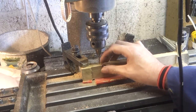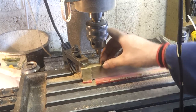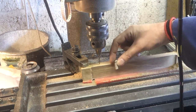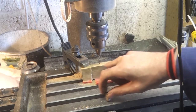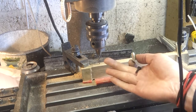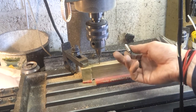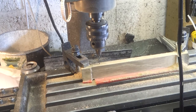Okay, that's going to be the screw that I'm using for the springs, and I've measured these out, and that's 20 mil deep. And then over here somewhere will be these little inserts, and they're 18.5 mil deep with an 8 mil. So I'll probably come down to 20 on both. I'll do these with a 2.5, which, if necessary, I can re-drill slightly wider. I think it needs to be 3, actually, but I'll start on the small side, and then these I'll just use an 8mm bit and come down 20mm.